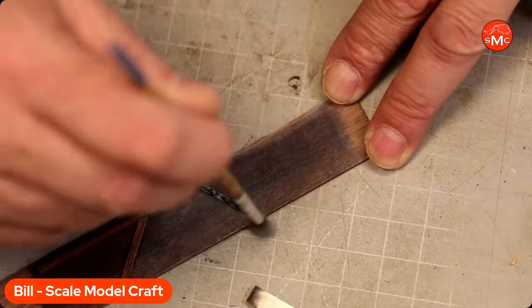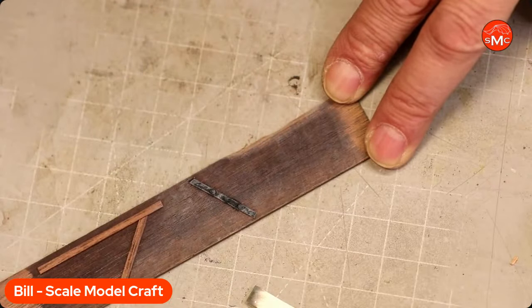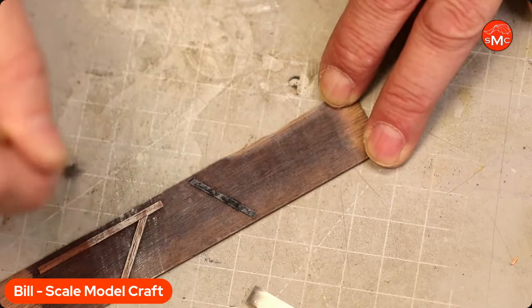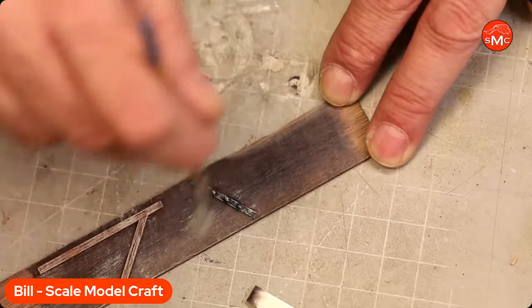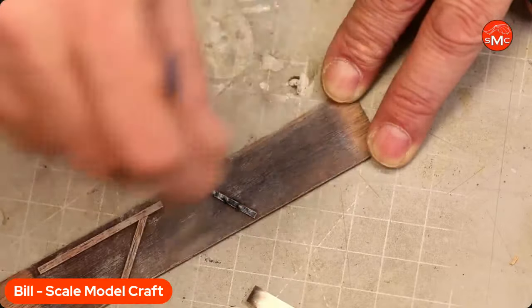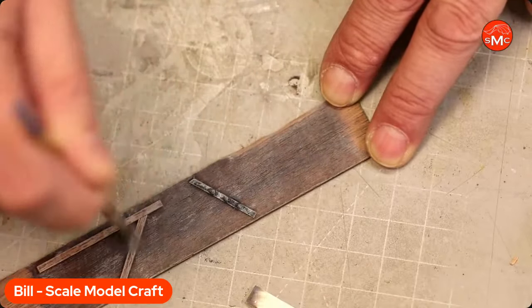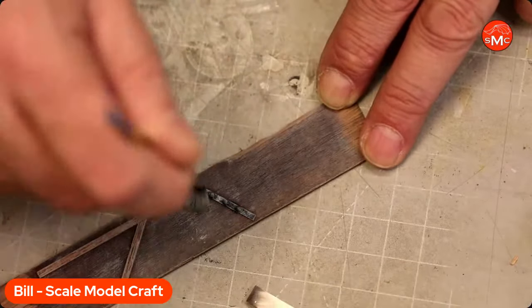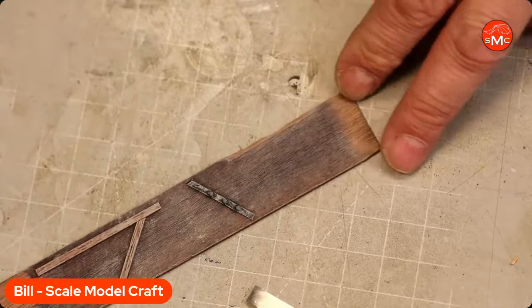and what it does is the vinegar is acidic, and it breaks down that steel wool. And by breaking it down, see, I'm getting pretty heavy on here. By breaking it down, it gets iron into the vinegar. Then after it's set, maybe overnight, you strain it, you take out all that steel wool and you're left with the solution. And when you put that solution on here, that's how we get the dark color.